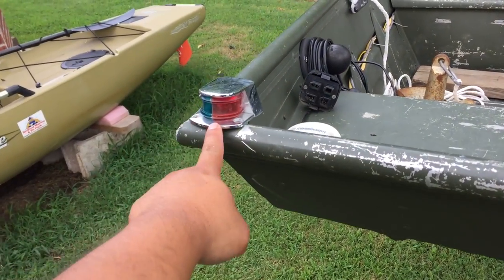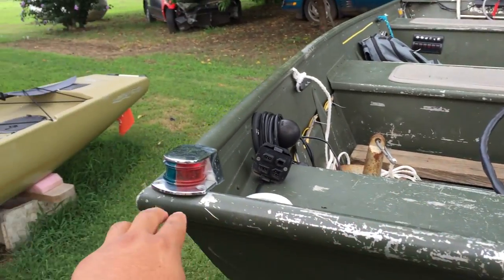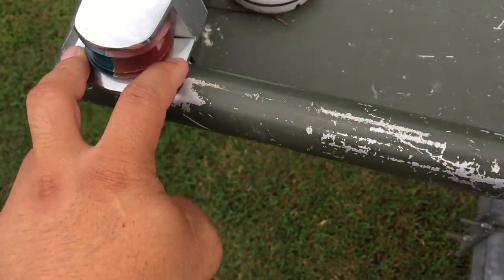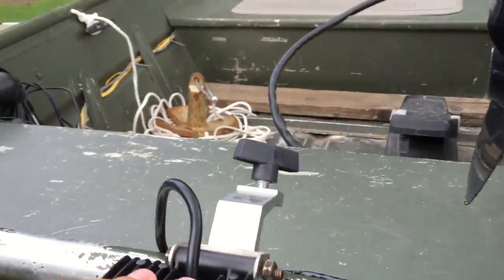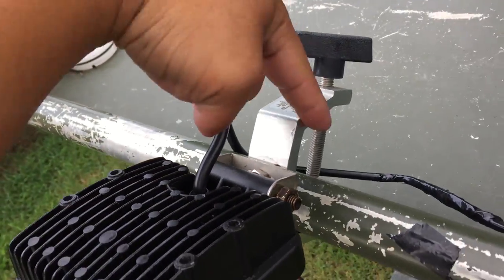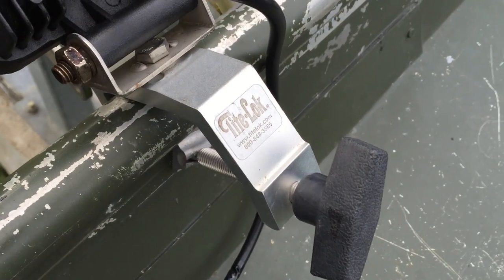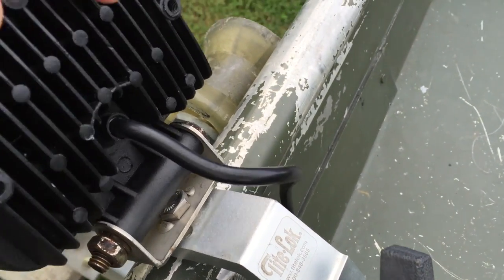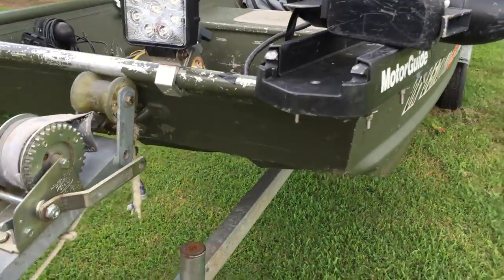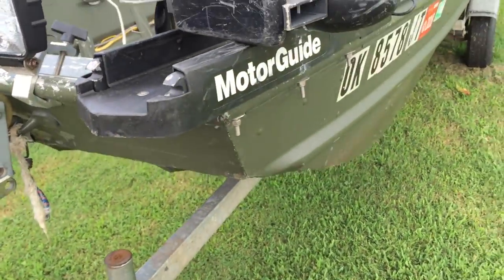The nav light wasn't originally mounted properly — it was on a piece of two-by-four just clamped to the front. I decided to bolt it straight down and line it up the best I could with the front of the boat. The light comes with some hardware, but the bracket piece I bought from Bass Pro in the rod holder section — it comes with a hole drilled in it and it works pretty well. The only issue is it has seized up a bit from corrosion since it's aluminum.